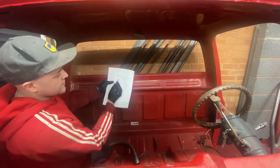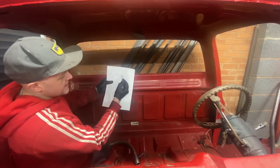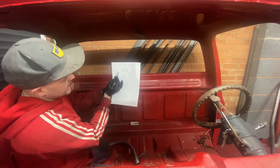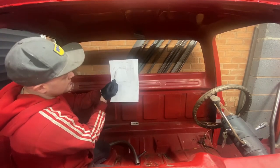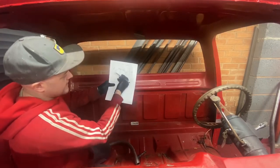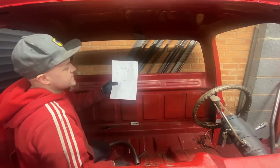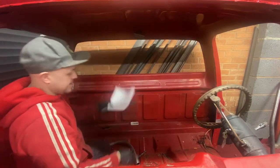Then once you've done your first one, which is 71 degrees in my case, at the end of the tube, which you can then mark on the bender, you then have the next measurement, which is 42. So you measure a straight bit of pipe, 42, mark it again, and that's the start reference point into your bender to do your last bend, which is 19 degrees, and then you straight. So that is simple. That is me then, I've bent a full hoop for the back.